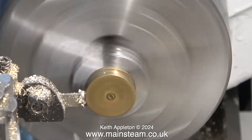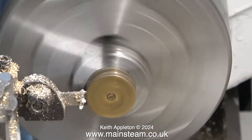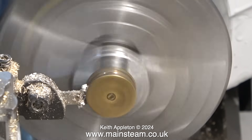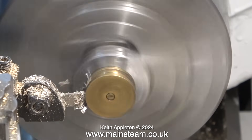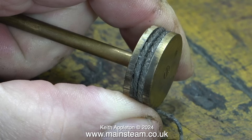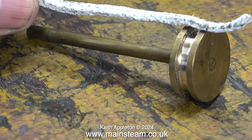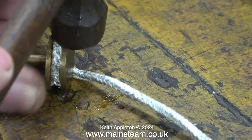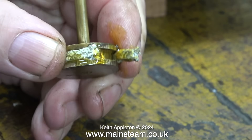I made the decision to remachine the groove so at least it was in the middle, in alignment with the piston rod. The original piston is a bit of a rattle fit in the cylinder anyway. I could fit a silicone O-ring but won't, as it won't last long without oil. Instead I'll use braided PTFE yarn — I give it a coating of steam oil, then tap the yarn into the groove, cut it to length, and once the piston is in the cylinder this PTFE-coated yarn will seal it perfectly.